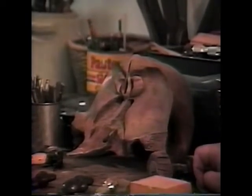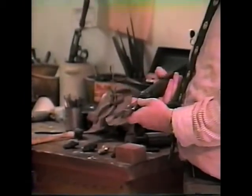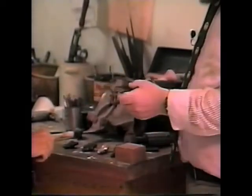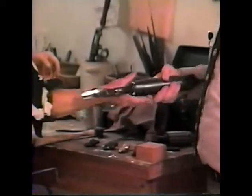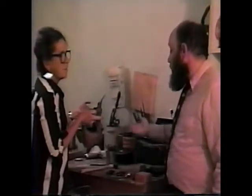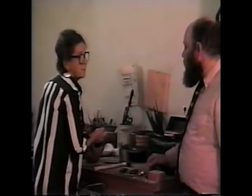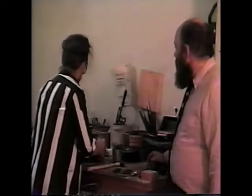We also have a lot of woodworking and metalworking tools. There's a sand bag — I just take my old pillows and keep covering it because the cover gets worn out. If I want to work on something and it wobbles, I stick it on the sand pillow and it stays where it is. For getting the gates off, I use a carborundum wheel, which goes on this grinder — that's how you get those lumpy things off. The finish I want, I do by hand.